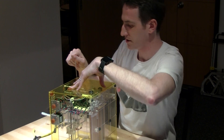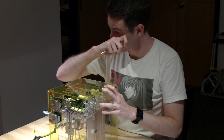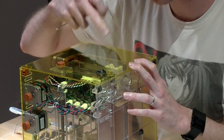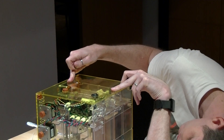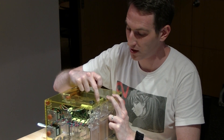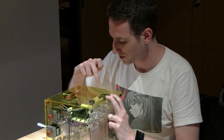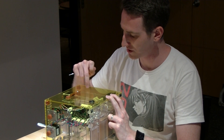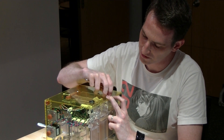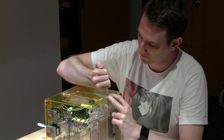Now, if you're going to do a Raspberry Pi conversion, you would probably want to connect up — on the power board there is a space for a five-volt regulator. There's space to populate a regulator on there, and also your USB cable for power only goes right there and then runs straight up here. Depending on which version you get, you may need to drill through the standoffs, or we're going to try to get them sized properly so you can put your M2.5 screws straight in without having to worry about anything else.